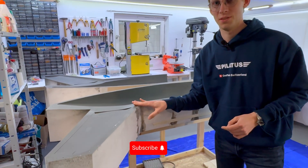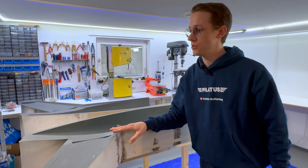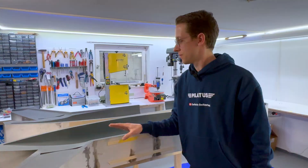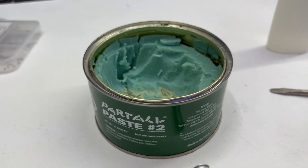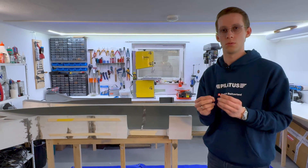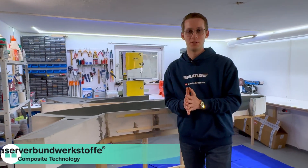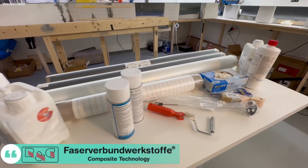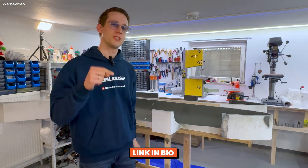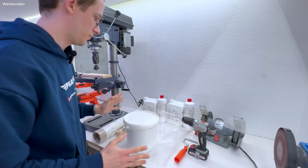Before we could cast these molds it was around two weeks of work just making sure that the surface of the mold is perfect. I applied three layers of wax, then a coating to prevent the epoxy from sticking to the mold itself. This project has been made possible by RNG — they provided me with all the necessary materials. If you have a similar project and need fabric, tools, or epoxy, check the link in the description.